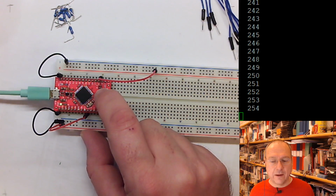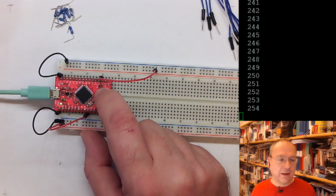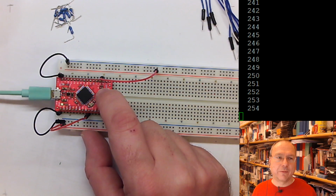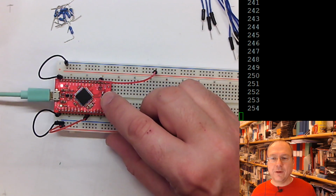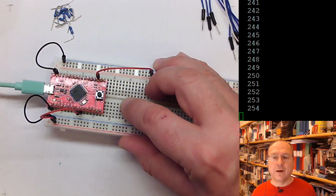In an Arduino, this is done when you upload code. Then the microcontroller is set into this programming mode by software. But this needs the Arduino loop running all the time and checking if the host PC wants to communicate. So there's a task in the background running in all your Arduino sketches, checking if you want to program something new, which is actually stealing performance from your microcontroller. So in this case, we trigger a reset by using this button on the board itself. It's just a different way to enter the bootloader.